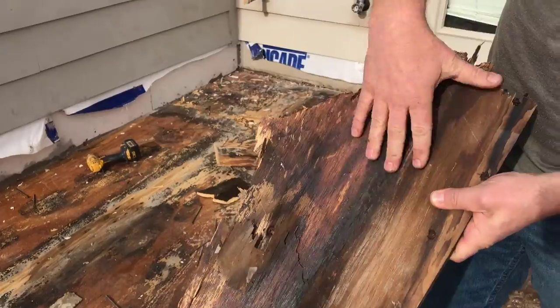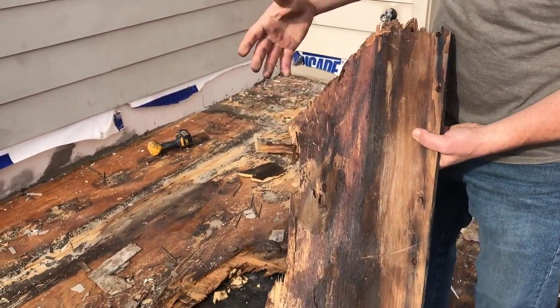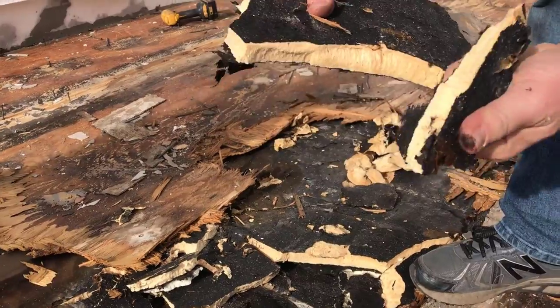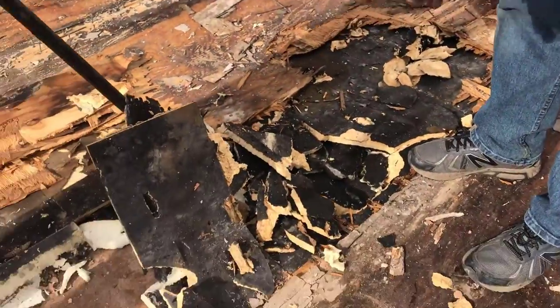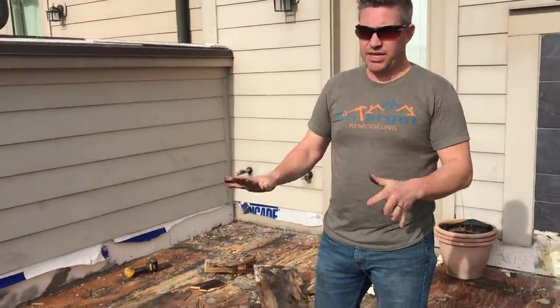The leaking and the moisture that's come through has just damaged that half inch plywood. The insulation has water in it. So now we have an expensive scenario where we have to remove all of this insulation that's just soaked with water. It shouldn't break apart that easy, but when it's soaked, that's what happens. Everything's going to come out. We've got to put a new system in — a new three-quarter inch plywood — and make this right.